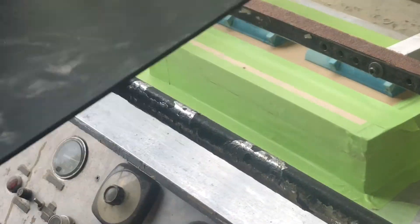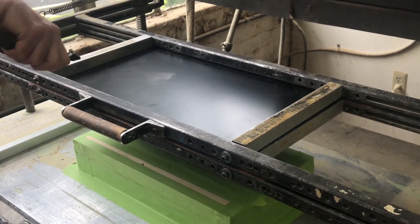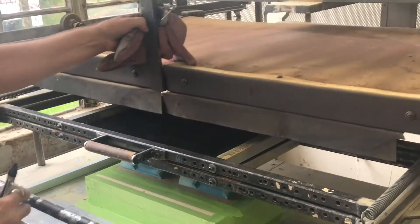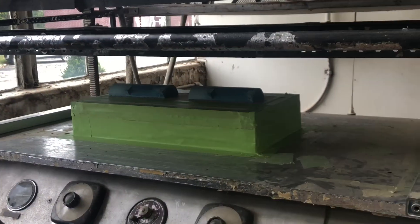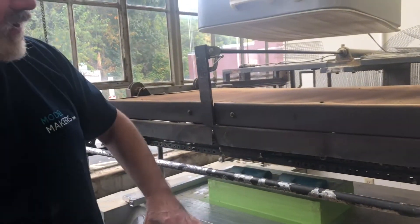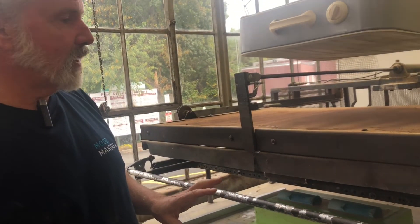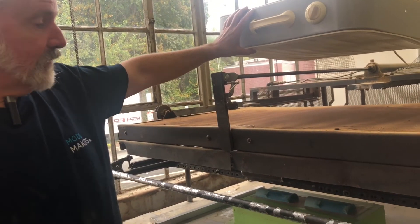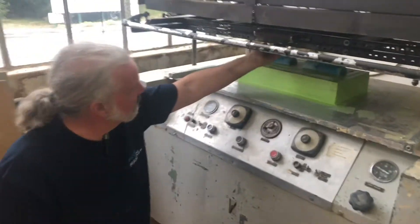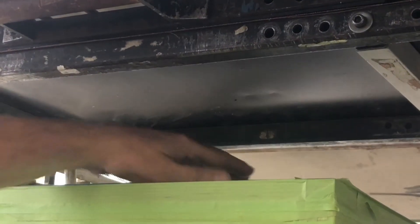You'll see once the soft plastic goes around it, a little more clearly how this works. I'm just going to blow the dust off this, pull the oven forward, and start the cycle. This is a semi-automatic machine. Ordinarily the frame would go down, the oven would go back, and the vacuum would kick simultaneously and pretty quickly. This has been under the heater for about a minute, and you can see it's starting to get a little bit soft — it's getting droopy.